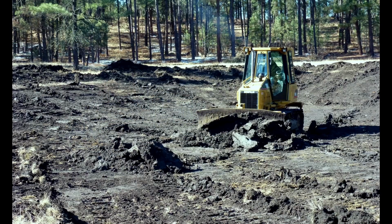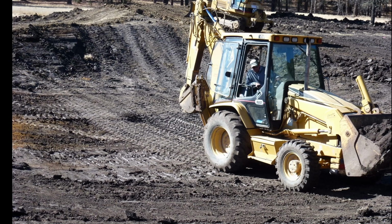You can tell that the dozer is pushing soil that's high in clay because of the large unbroken clumps and the shine on the smooth and compacted surface of the clay that was cut by the dozer blade. One can also see the brown-colored sand in the basin, and this shows us that the dozer should not dig any deeper to remove clay. The dark-colored clay is now being spread and compacted over the light-colored sand.